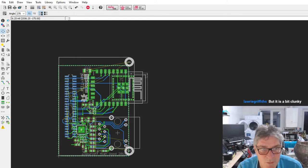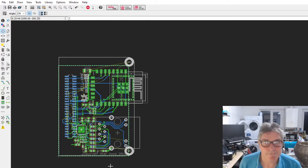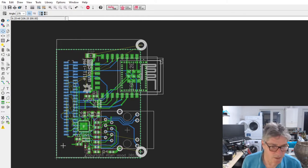Yeah, I was thinking of something perhaps a bit more elegant than that. I'd want to connect it over the pins we've got left on the tile that we've not used, which are SPI, basically. So it has to be an SPI based Wi-Fi solution. Anyhow, bit of a distraction. So yeah, I am working on a network tile that looks something like this. The only thing I haven't worked out yet is the Wi-Fi bit. Whether I should have the Wi-Fi bit, and if so, what Wi-Fi bit?